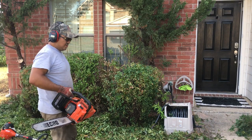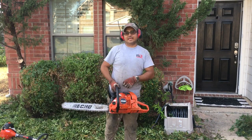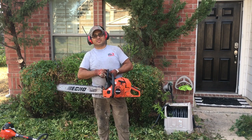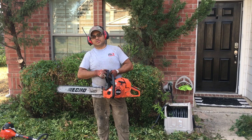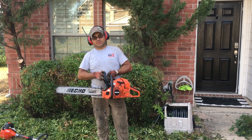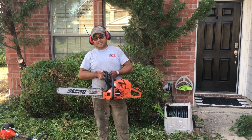Without that chainsaw oil, you're burning up your blades and it takes forever to cut. It adds not only lubricant, but it seems to really grab onto the wood. I've tried to use motor oil. It just slips. That bar oil really just grabs the wood and lets you just chip it out of the way, tear it up.